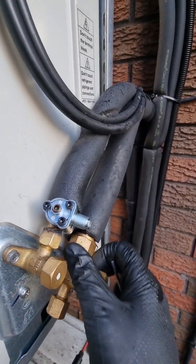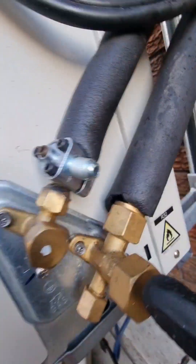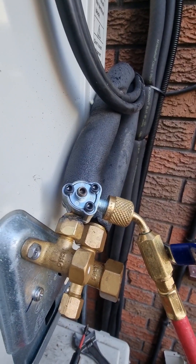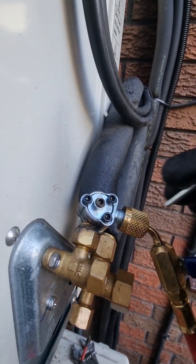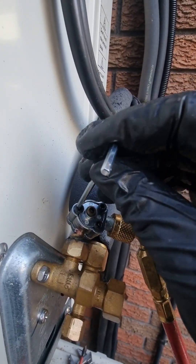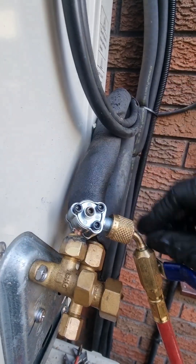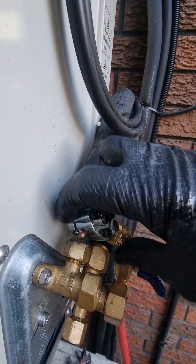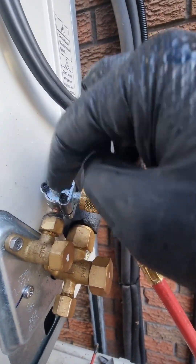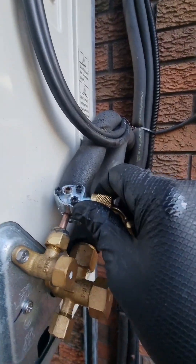We're clamped on there. Bear in mind, there is no Schrader valve inside there, so you want to remember that. We've got our line attached, so get this into position. You want to clamp this down until both halves meet. The other thing is, you want to go around and turn — don't just whang one of them down and then the others, so tighten them evenly.